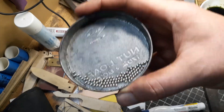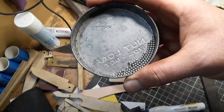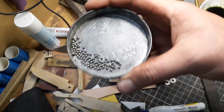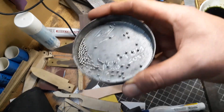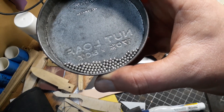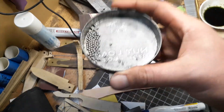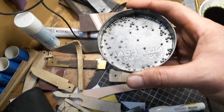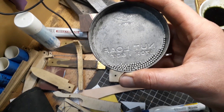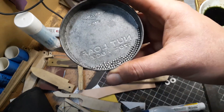Here I've got about a hundred ball bearings, but the number of molecules in even a small piece of steel is far more than that. You can imagine this happening on a very large scale with billions and billions of steel molecules, all suddenly arrested, with all those little imperfections present. How hot you get it dictates how much these things are moving around, and how quickly you quench it dictates how they are arrested into a lattice. That's why the temperature and the quench speed matter in the formation of that lattice.